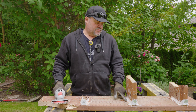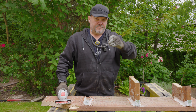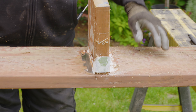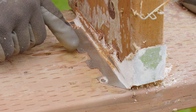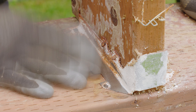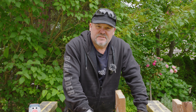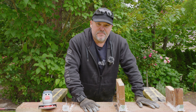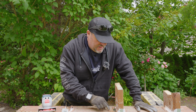I have a flapper disc on a grinder. I'm going to hit it right here, get all the surface rust off, and see what this hanger looks like. Then we'll do the really rusty one too. You can see that even though we got all the surface rust off, it's still pitted — the rust is actually starting to permeate the steel, and we had to grind off a couple of nail heads to get down to the surface. I don't suggest you ever do this on an installed deck because you're compromising the joist hanger. This is just for a sample — it's not a remedy. To rectify this, you would have to pull these joist hangers off and put brand new ones on. You can't sand it out and fix it.